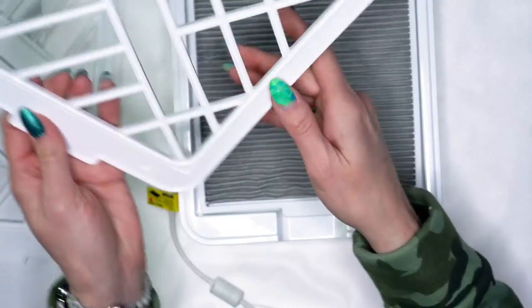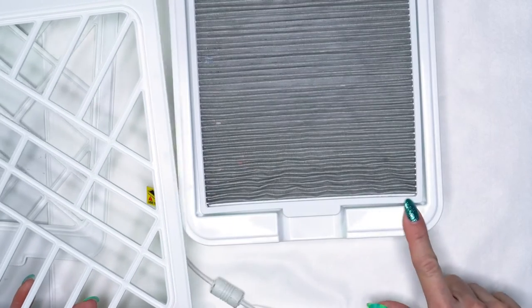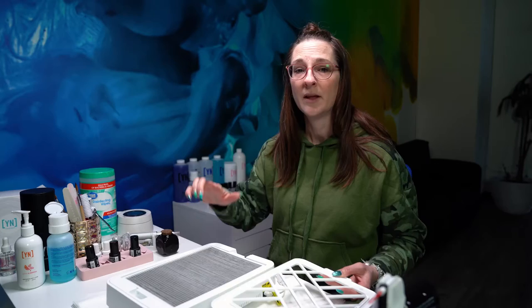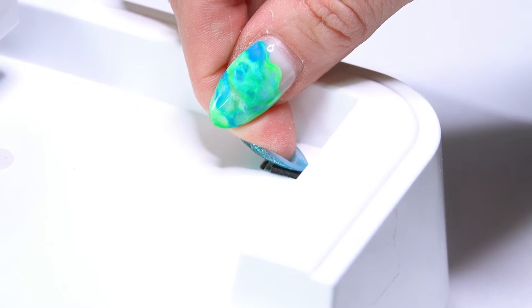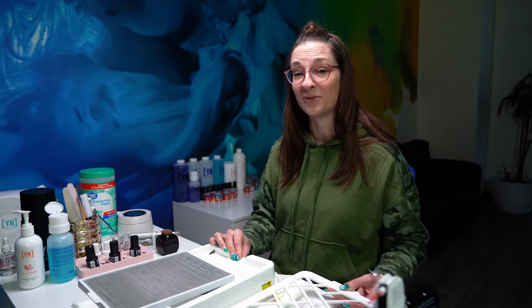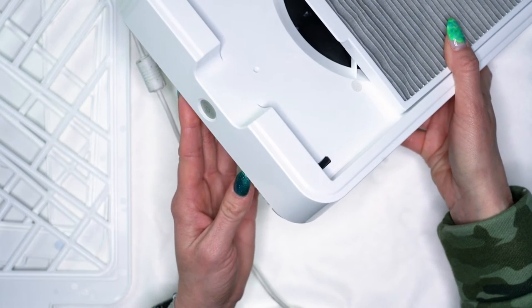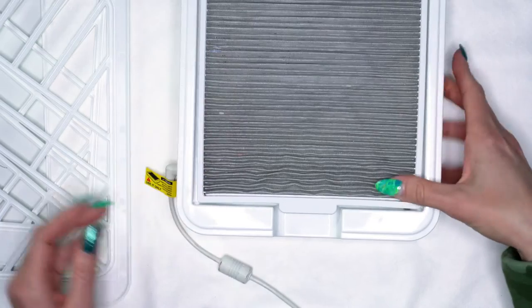Here's a challenge that I've seen happen — it's actually happened to me. Inside, what holds the top part down are four little magnets. These magnets actually adhere to the corners of your dust extractor, and that's what pushes your filter down and engages that little lever. That lever is what allows your filter and your dust extractor to continue to run. If your filter is not positioned and that lever is not pushed down, then your filter is not going to engage, and you're going to get that flashing blue light of death. Make sure that your filter is set into place and it engages.